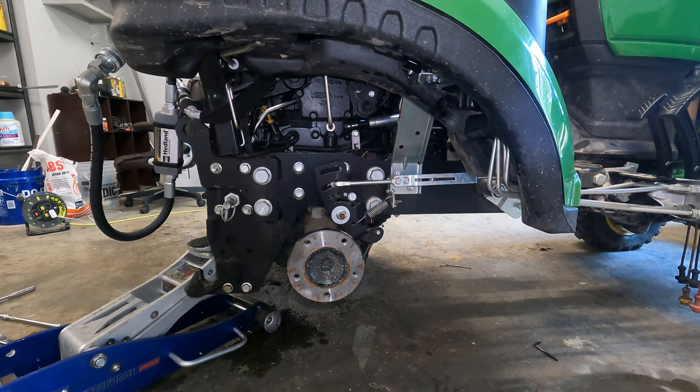So that's what it does. It increases flow, does not increase the lift capacity, and that's because it does not change the pressure at which your hydraulic system runs at.